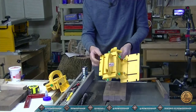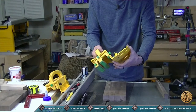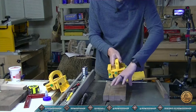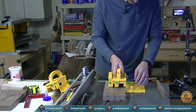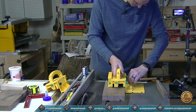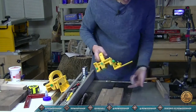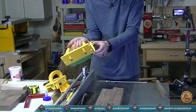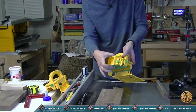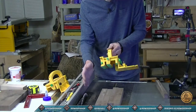I'm not sponsored by Microjig, but doggone, they make a really nice thing. So this is the Advanced Gripper. You can see it has a much wider plate right here. It has a little hook on the backside. So if I was going to mill this whole board right here, I could actually push this little board into the edge. When I push forward, it hooks this board and pulls the board through from the backside. It also has a little thing here that will push your boards from the back. It has a spacer on the side so I can push it away from the fence a little bit more, because sometimes getting the spacing right is a little weird.